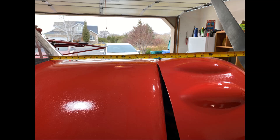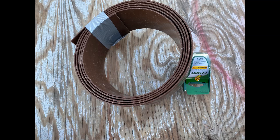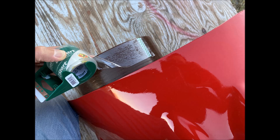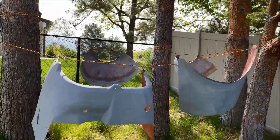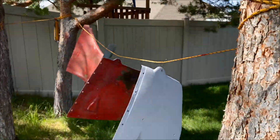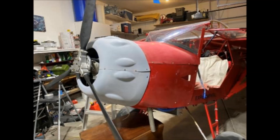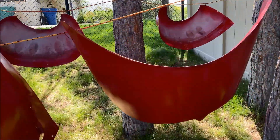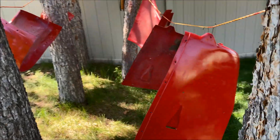Something that took me by surprise was that the cowling was too short for the 912, so I had to make it bigger. I went to Lowe's, got some materials, put tape on it, then laid fiberglass over it — and it worked really well. I incremented the length by 2 inches, then painted it and presented it on the plane. The hardest part was sanding and making it look like nothing had been done. The 2 extra inches of fiberglass were easy — it just took a lot of sanding to make it look neat.